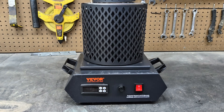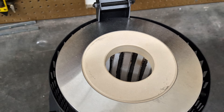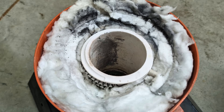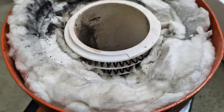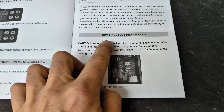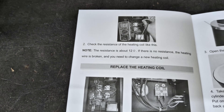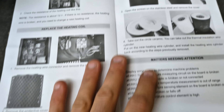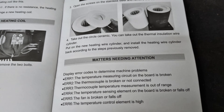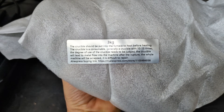Let me give you a quick overview on the internals of this. These heating coils are actually vertical and they're inside with the crucible. Unlike other brands, which have the heating coil on the outside in a spiral surrounding the ceramic — I'm not quite sure which one is better. Another reminder on the heating coils: they do burn out after some time, they don't last forever. Inside the directions, it gives you a walkthrough on determining if your heating coils have burned out, and it even gives you instructions on how to replace them. There is also a safety label on the crucible explaining that they are consumable and really only last 10 to 15 times.